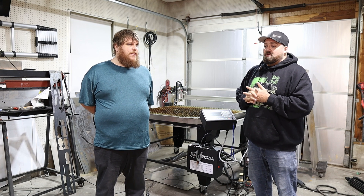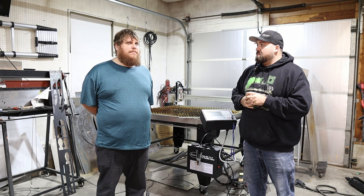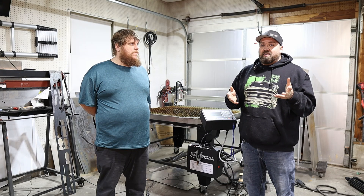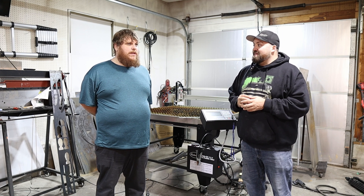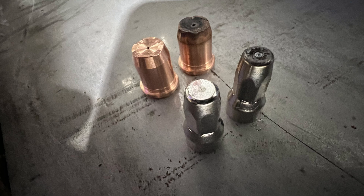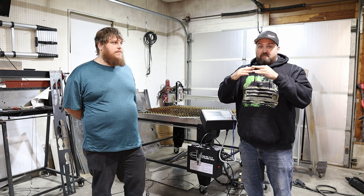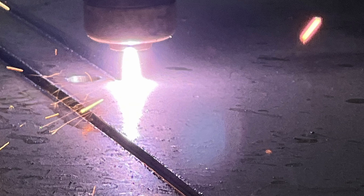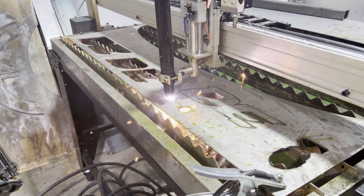One of the things you definitely want to keep an eye on is consumables. I think it only comes with one set, so I'd recommend grabbing a couple of sets when you buy the machine because you're going to burn through them. Once you start pulling your hair out thinking you've messed something up in the settings, it could actually be the consumable wearing down causing your cuts to fail. If your settings aren't exactly where they need to be you'll burn through them pretty quick. There were numerous times where we ran into the material as we were learning how to set the proper height. This has auto height adjustment but when cutting thinner material it's going to pucker and pop, and sometimes the arc isn't adjusting high enough because your initial settings are too low — so you could have the arc adjustment wrong and it just won't have enough leverage to compensate. That will chew your consumables up like no tomorrow.